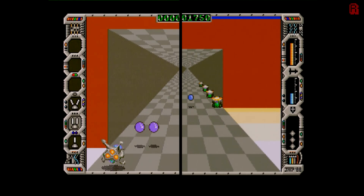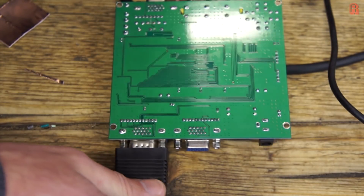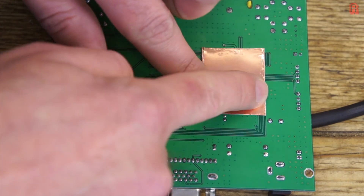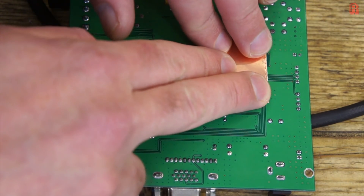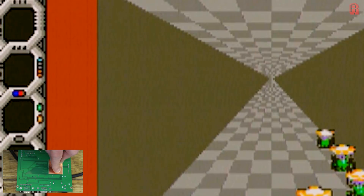Moving on to a solution suggested by user Benutza on the a1k.org forums back in 2015 — this isn't a new device, we're on revision 3, and there's even a revision 4 board out there. The link to his original post is in the description. The traces on the back of the board run from the RAM to the IC performing the conversion, and Benutza suggests sticking copper tape over them to add a layer of shielding. To test this, I placed some tape on the board and moved it around while watching the image, being careful not to contact any through-hole component pins. The level of noise on the picture visibly changes — it reduces when I press the copper tape against the traces and returns when I lift it.